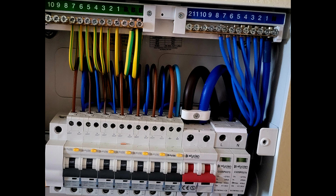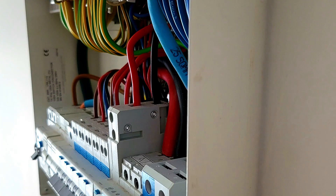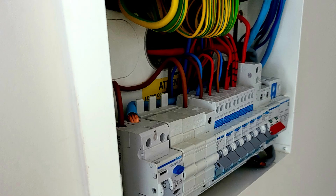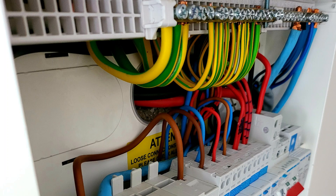This next board is a swap-over, so these are pre-existing cable lengths — you're tied to what you've got. With the cooker circuit there, it is what it is; there's not a lot of extra length to reposition into the terminals any differently. They kind of drop down with a nice loop as best you can, CPCs loop around the top, and any excess length you're lucky enough to have you can hide behind the earth and neutral bars. Sometimes you're just stuck with what you've got.